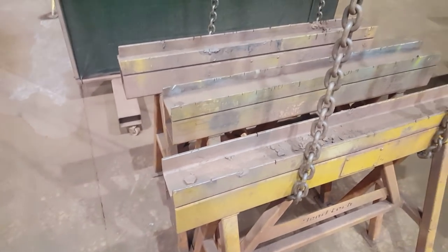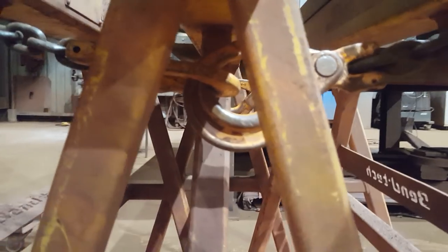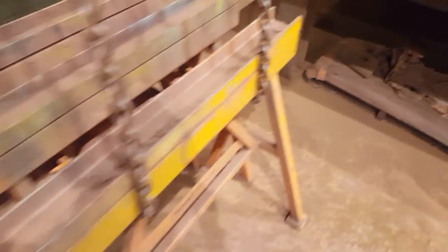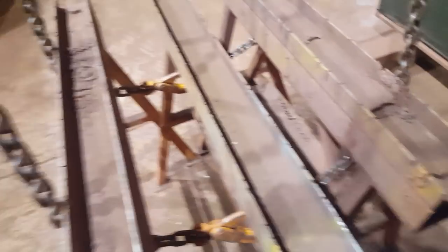This is a four-chain setup and this is what you call the handshake. So if the crane driver goes, 'hey man, just handshake it,' this is what it means. How they call it the handshake is as we look under here, the two hooks handshake together on each side. The utilisation of this is if you've got two chains on the hook and you're going from two to four, you can use this — it's pretty much a basket but you just connect the chains in the middle.